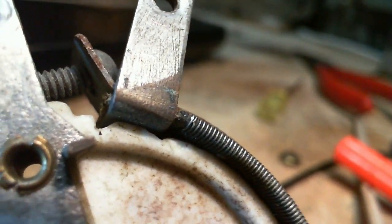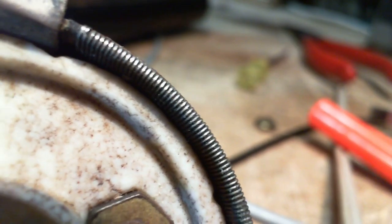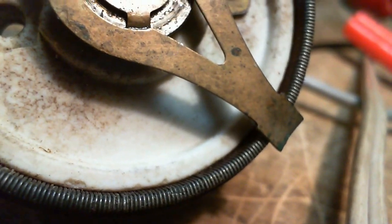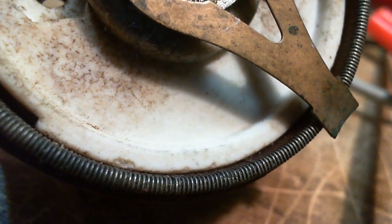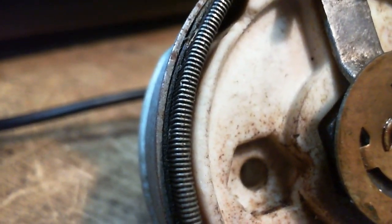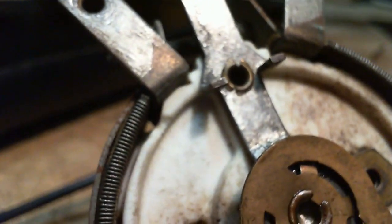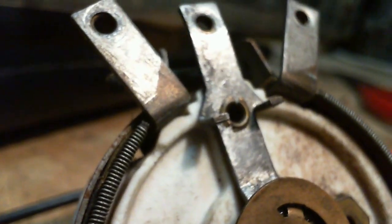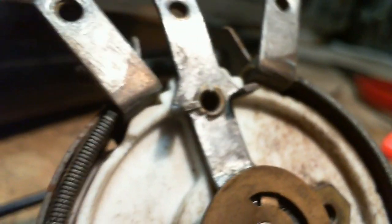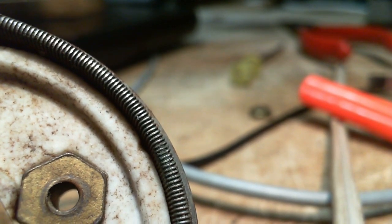So there's a form. You can see the end of it crushed in there with fibrous ends. So there's a fibrous material, of course, the wire is wound on. Ooh, there's some damage to it. Now, this is probably nickel chromium wire. Hold the camera more steady. I think you can see my heartbeat in the camera shake. Let's take a close look at this broken area here. Right in here. Now, this is where the nonsense happens.